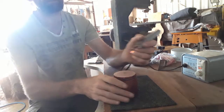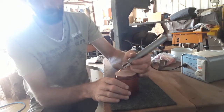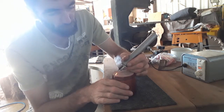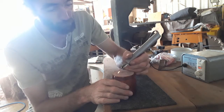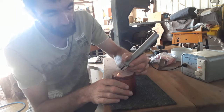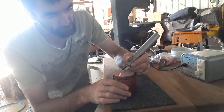The drama with that is you're not working together with the piece, so I tend to like resting just my hand on the edge there like that, and then I work on the opposite side of the cup, and whichever way some people feel comfortable writing over here, some people feel comfortable, there's no right or wrong, I'm just telling you how I do it. And I come in a bit from the edge so the edge can sit on the bench top, not scratch away, and then it's just a matter of turning the cup around to each letter that you need